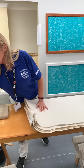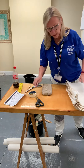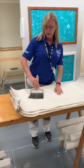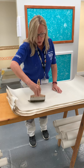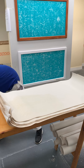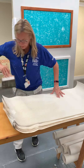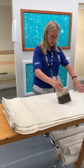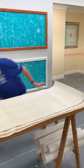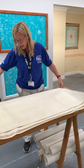I'm going to check my soaking times — five to seven minutes. I'm going to apply my paste, and when you paste, remember: start in the centre, brush out to the top, not brushing in — brushing out to the top, then brush out to the bottom. Again, centre, brushing out to the top with plenty of paste, then brush out to the bottom. Mix a nice big thick batch of paste for this.